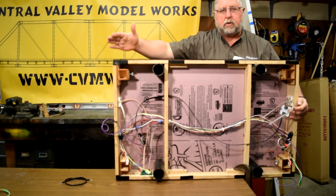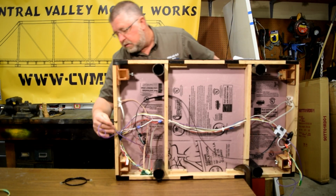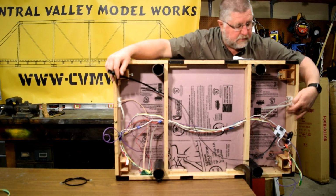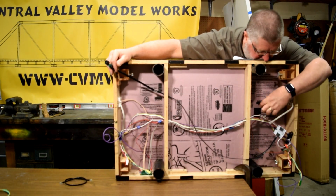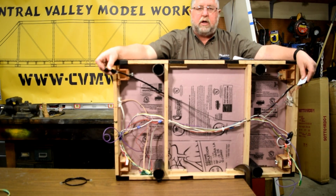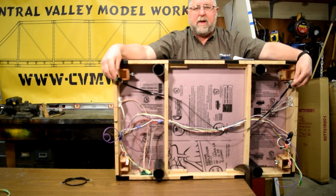because that gives us one crossover, which is this connector at this end, and everything else is straight through, so that we have an odd number of crossovers from this connection, right to this connection. From here to here is an odd number of crossovers, and these get mounted.